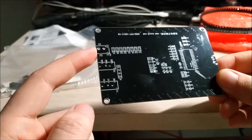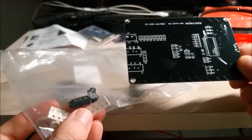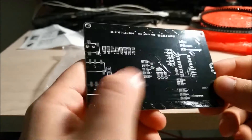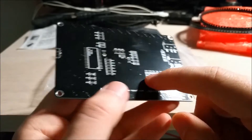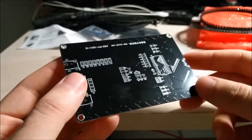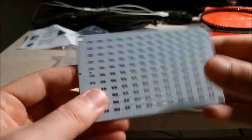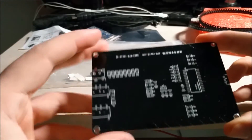There are some jacks for DC input, and J1 and J2 are probably audio in and audio out — surface mount 3.5mm jacks, 4-pole interestingly enough. There's a test pad area, probably for testing PCB wiring. Some decoupling capacitors, a power switch. No crystal — everything is done inside the one chip, maybe with a PLL and an internal RC oscillator. The PCB is actually pretty thick and hefty. I can 3D print a stand to hold it upright, stick a battery on there, plug in audio, and we're good to go.